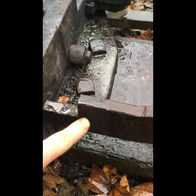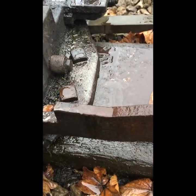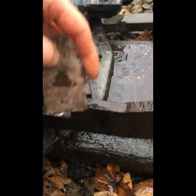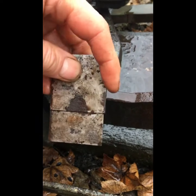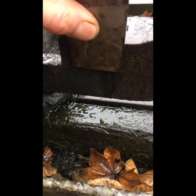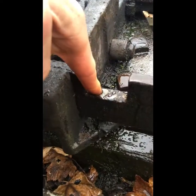You can make a mark on the top where the rod bangs up against the bar. Then put your points over the other way — you'll end up with a mark on the top where you're going to cut your FPL. This is where your point gauge comes in: three and a half mil, five mil. You'll notice there's a slight little lip there. If you sit this on top of your rail, you now have a mark by which you can scribe round and then cut out your hole for your facing point lock to go through.